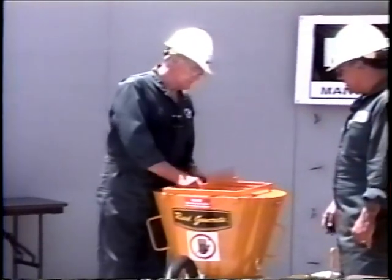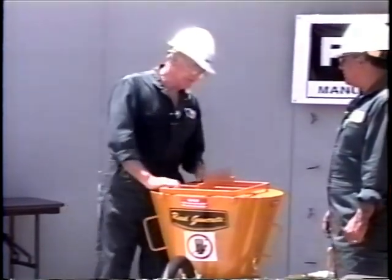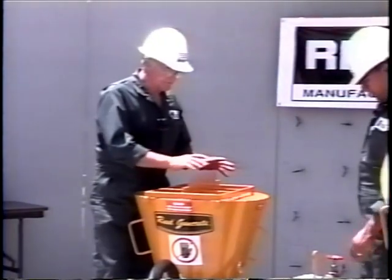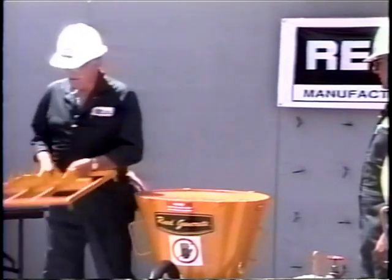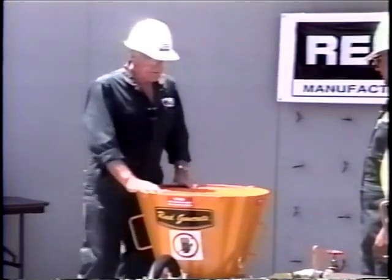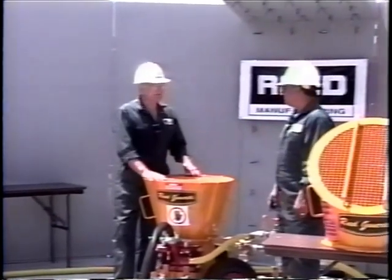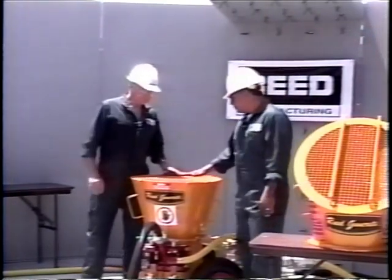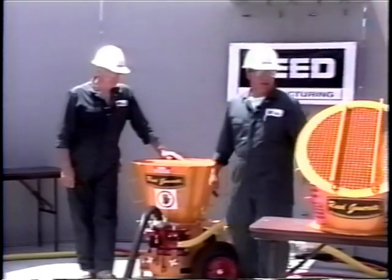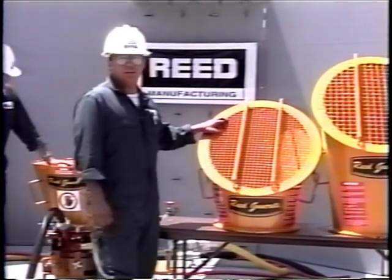Another hopper is mainly used with refractories, anti-acid materials, and abrasion-resistant materials — materials where you must control segregation and keep the mix more uniform. You can use a direct bag breaker by dumping material right in, or pre-mix and convey the pre-mix material directly into the hopper. Keep the hopper approximately three-quarters full, which helps tremendously with any blowback. This hopper is used primarily in the refractory field; the premix hopper is used for ready-mix trucks, swimming pools, or shoveling into the machine.